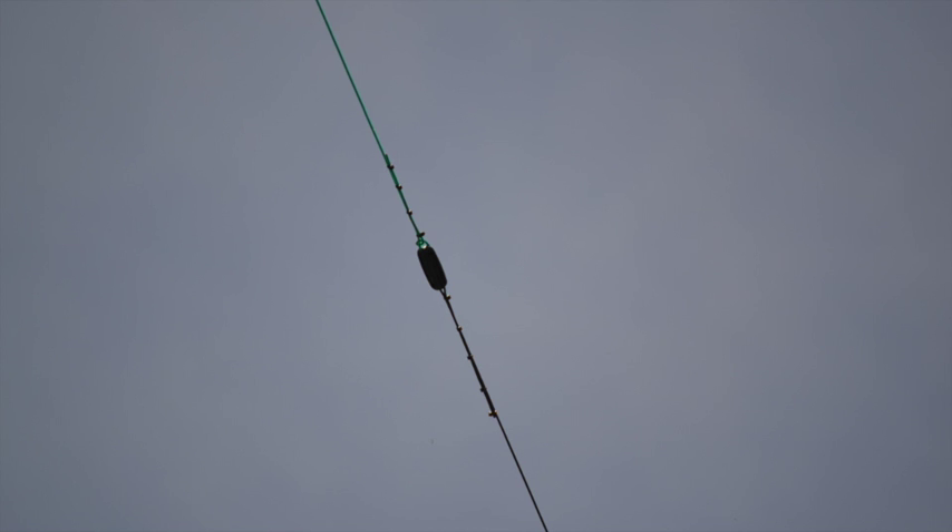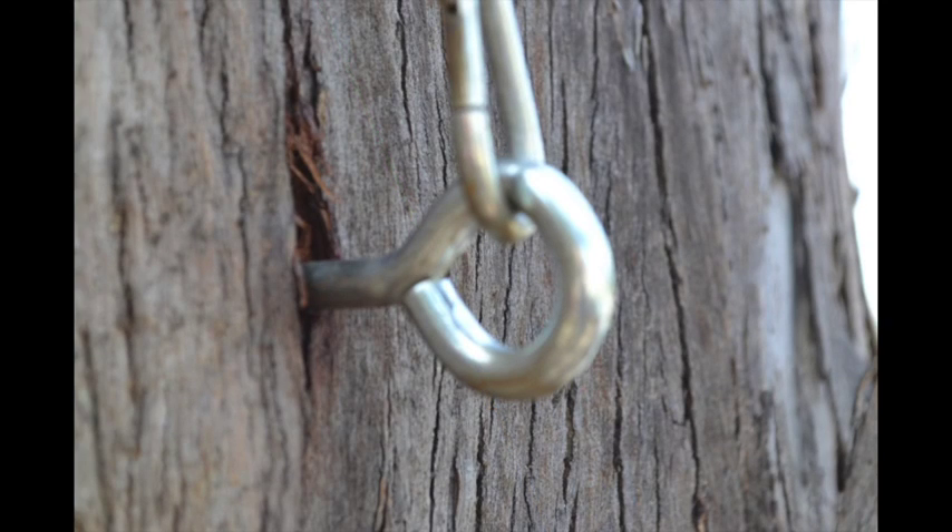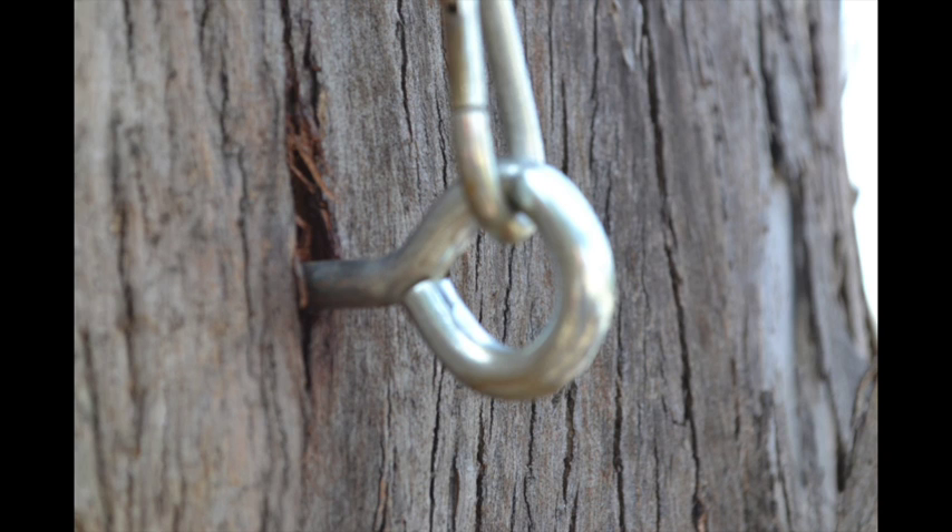There might be some induction, but it doesn't seem to be an issue. The antenna wire and the guy wires are simply looped back and tied off using zip ties. To anchor the guy to the tree, I've used very heavy duty eye bolts. Early on, I actually tried a lighter duty hook, but without the spring in the system, the movement of the antenna literally reefed the hook out of the tree during a storm one night. So I guess you get what you pay for, and in this flexible system I've gone for strength.